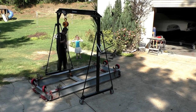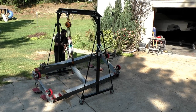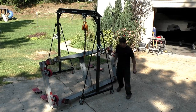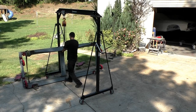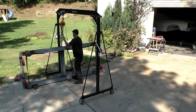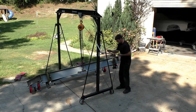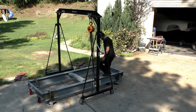The hardest part about this frame jig - I've done it without a shop crane before - is going to be flipping it over. It's a heavy I-beam and I can barely lift one corner of it myself. This two-ton shop crane really makes life a lot easier. I've used engine hoists in the past. We have to flip them over because we have to weld both sides - as thick as the metal is, we want this thing to be really strong. This is how I flipped it over and got it on its four wheels so we can do the final welding on top of the jig.